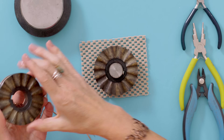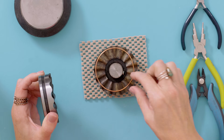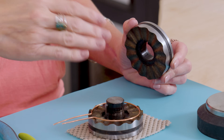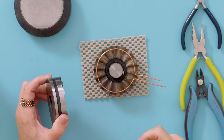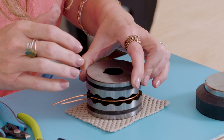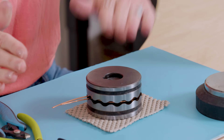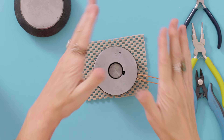Now I've got it opened up and so the next step is to take my bangle that we're working on and pop it down into the bangle die. It doesn't matter where the two little legs are just as long as the bangle is centered on the bangle die. Now if you made a larger bangle, it can be a little bit harder to get this to work because the bangle die is not really big, but you can overlap certain spots like you can overlap your legs a little bit. It'll give it a little bit of a divot in one spot, but it's okay. So I'm going to drop this down - there's a little key and a little matching part that goes right here on the bangle die. You just want to line those two up and then bring that down onto the top of your metal. So legs sticking out the side, bangle centered on the inside of the die, and now the two wavy pieces are separated out and we're ready to go.